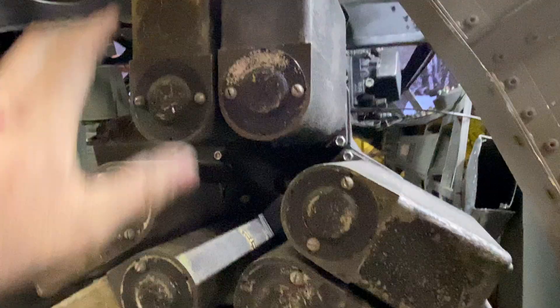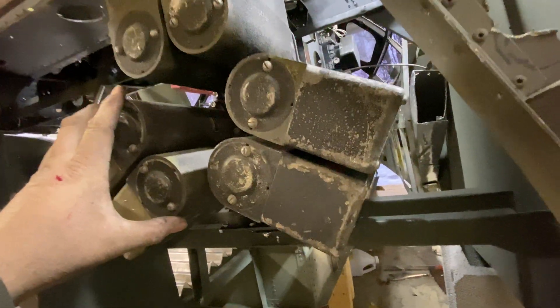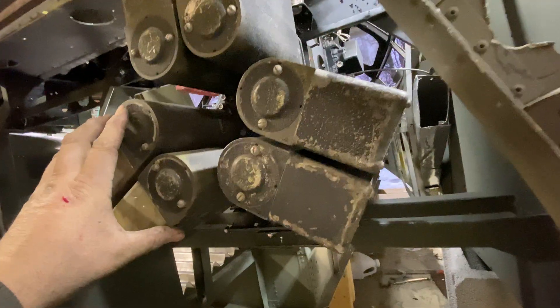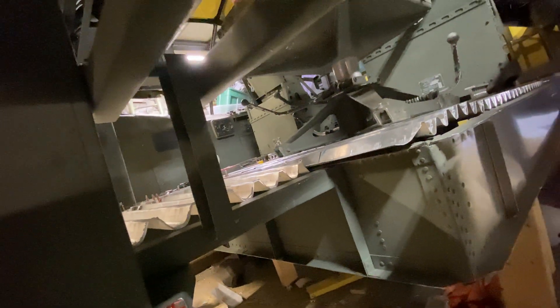With that fixed, I was able to install the Curtis electric propeller synchronizer. It's on shock mounts — old shock mounts that are pretty loose, but it is firmly in there. I actually had to redo this because I initially thought these beams were a total of eight inches apart; I didn't follow my own advice where they're supposed to be five and a quarter. So that was fun.